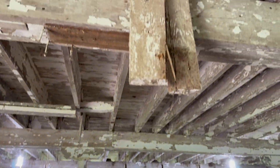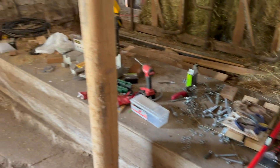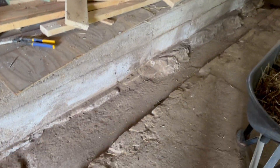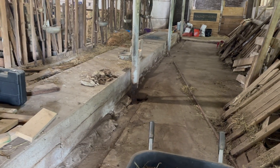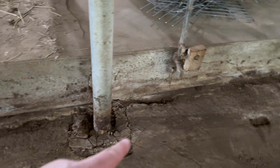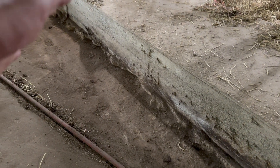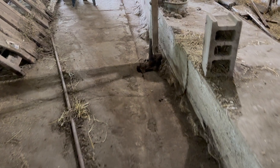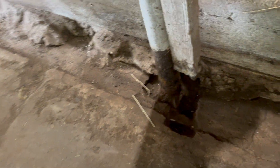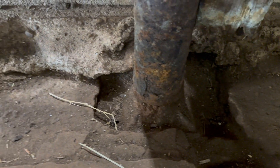I've removed this one completely — it's actually here and some of the pieces are up there. But as you can kind of tell on the second post here, we really start to take a departure from the wall. It's all cracked up, broken, and things start to fall away, potentially down. The footings have settled quite a bit there — you can see there's a definite gap.